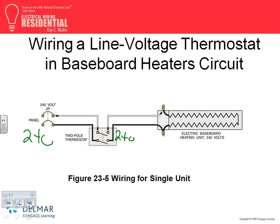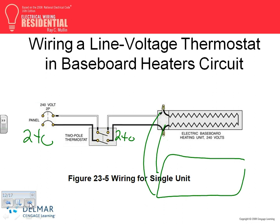All right, so here's how it works. This is a thermostat, guys. You set your thermostat at the desired temperature, which is 95 for DJ, and then this heater keeps cooking until it reaches 95, then it stops. There's a switch with it that opens. It opens both poles if it's 240. Most baseboard heaters, guys, you can wire them directly from here if you have another one.